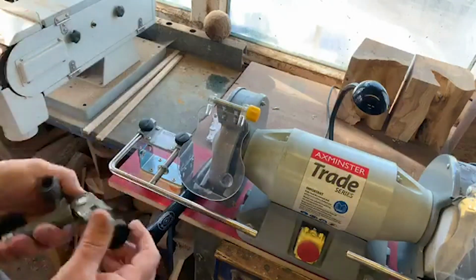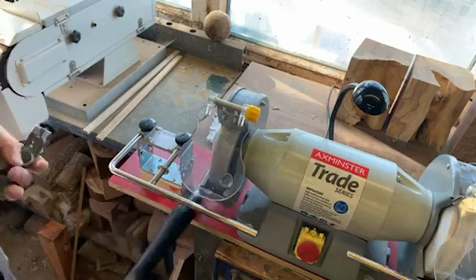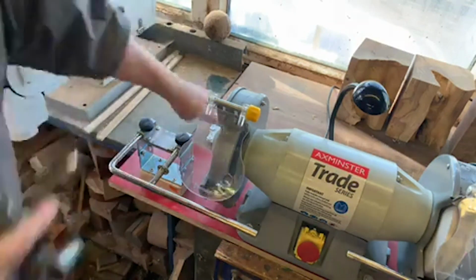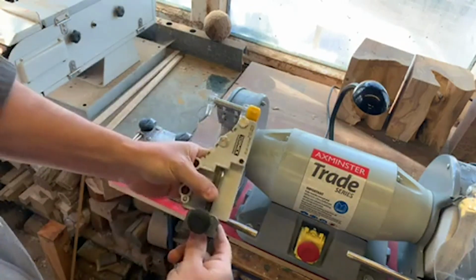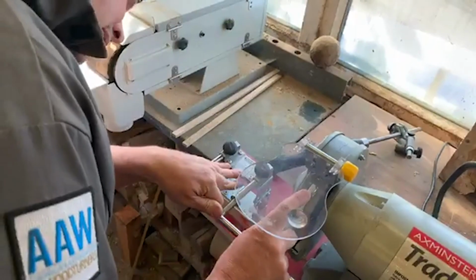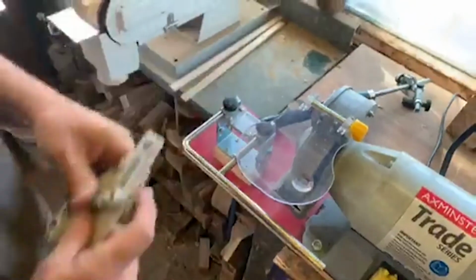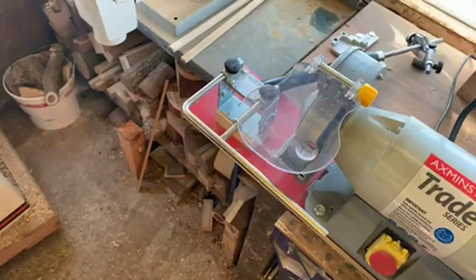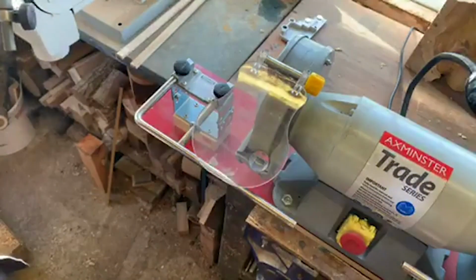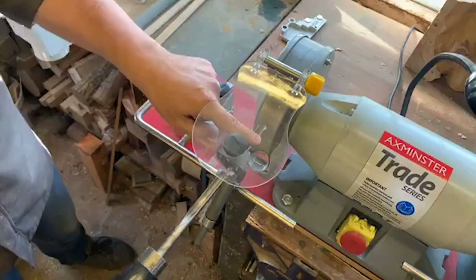So that's going to be position 4 on my jig, 65mm protrusion. Well, that was luck, 65mm protrusion, got that first time, that was good, and then hole A, setting up in exactly the same way. There we are, on with my visor. So remember, this is now running about 1800. Sorry, no, beg your pardon, about 1400.